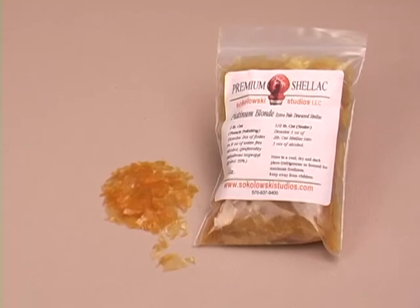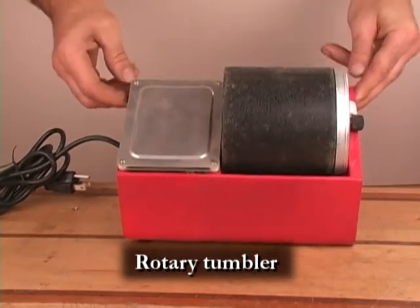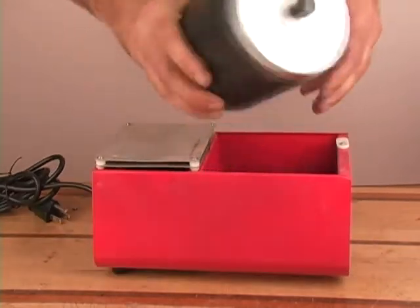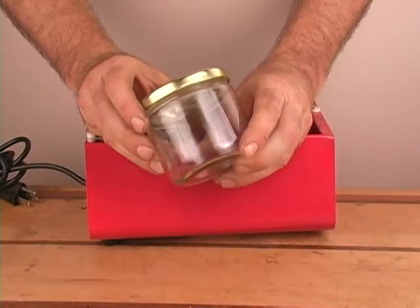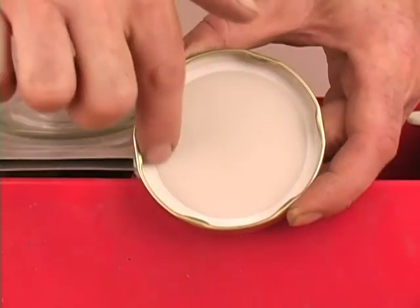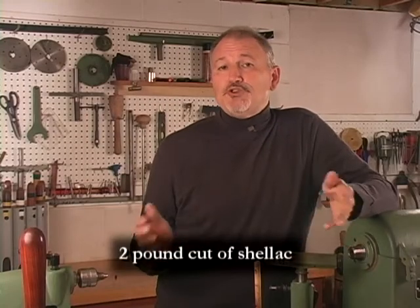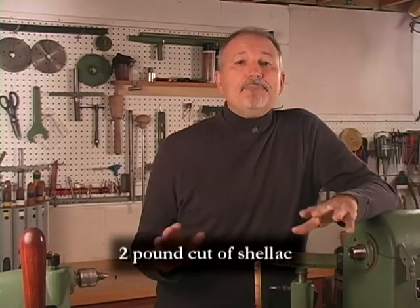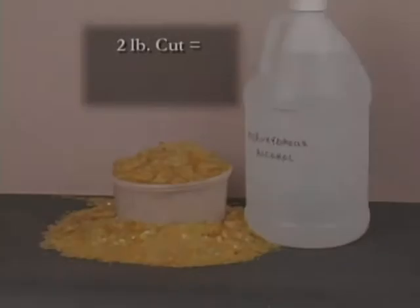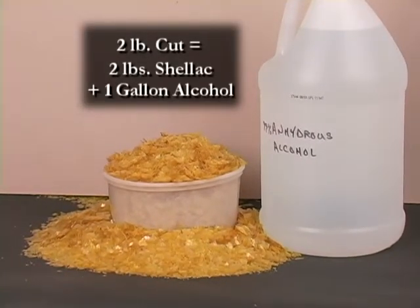Select the grade of flake you'd like to mix. For mixing shellac, a rotary tumbler is ideal — used in the polishing of stones. I won't be needing the stone-polishing barrel; in its place I'll use a 13-ounce pickle jar. Just make sure the jar you choose has a good rubber seal on the inside of the cap. I'll be mixing a 2-pound cut of shellac. Pound cut is the measured unit of shellac flakes dissolved in a gallon of alcohol, so a 2-pound cut refers to 2 pounds of shellac flakes dissolved in a gallon of alcohol.